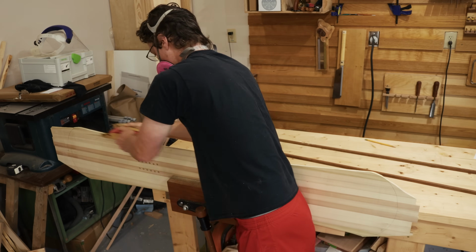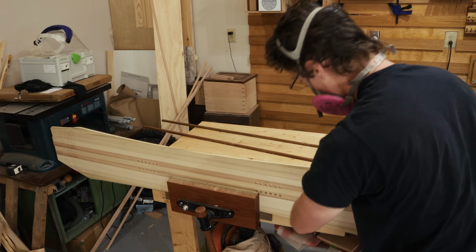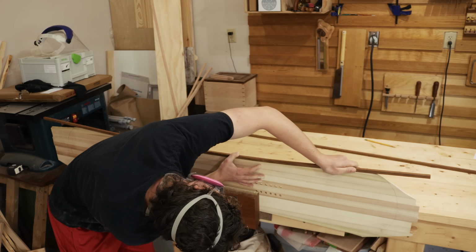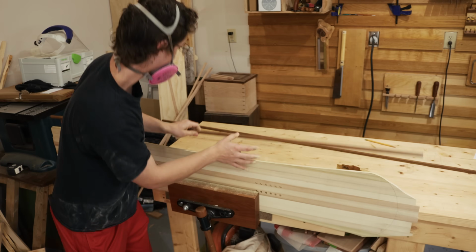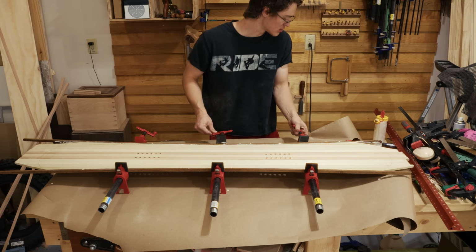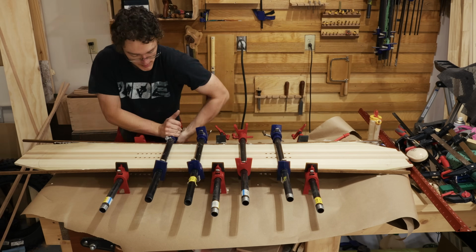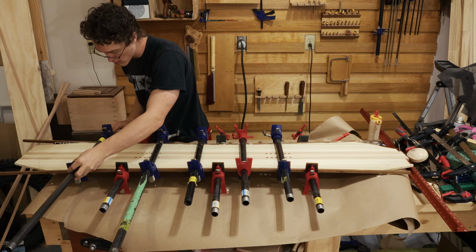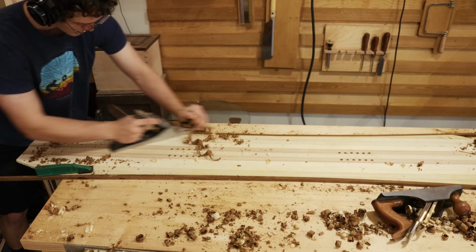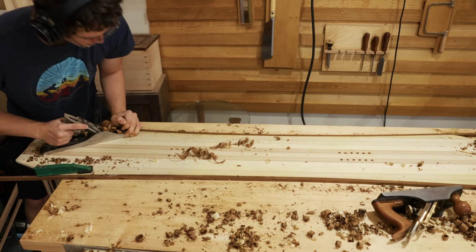After cutting out the curb, I sanded any irregularities from the cutaway and tested that the joint was tight. Once satisfied, I glued both of the sidewalls onto the core. You'll have to let me know if I use enough clamps here. Then, using a hand plane, I flushed up the sidewalls with the core and then cut the rough shape onto the ends.